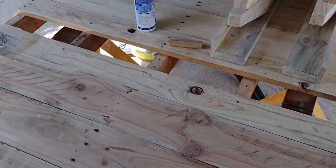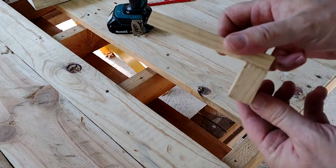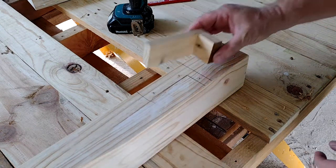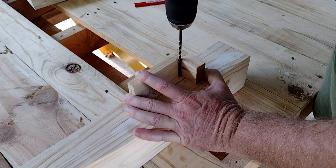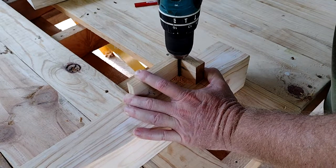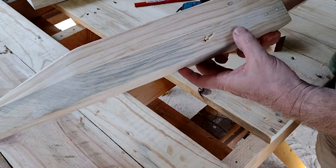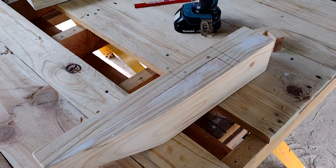I've got this very useful long four-millimeter drill bit, and I made this straight drilling guide — it helps me drill square and straight through large pieces of timber like this one. I just place the guide on the piece of timber I want to drill, try and keep the drill bit exactly in the corner of this guide. That helps me start a nice straight drill hole. There are four legs, three holes in each leg.